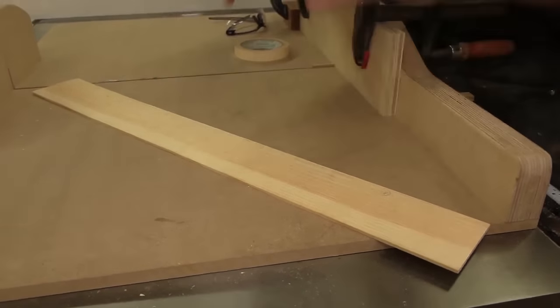Okay, so I'm just holding this flat and just going around. And I think I got enough there. So there we go. Nice and true. And that will be the bottom. And I cut another piece earlier and I hand planed one face. It's under the magazine. All right, so I hand planed and I cut this piece to size. So this is the same thickness, and it's just a little bit larger than it needs to be. So this surface is planed, that edge is planed, this will go down, and look at that.